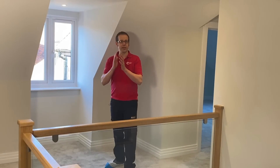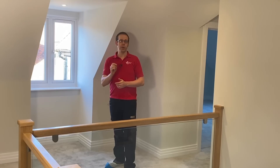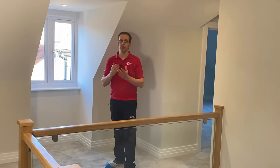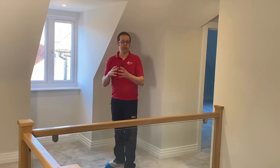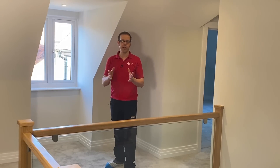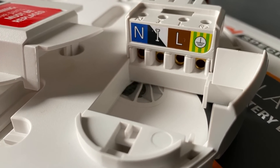It's best practice to keep the smokes on the same circuit as each other for a couple of reasons. One is that it makes safely isolating the smokes easy if they're fed off the same circuit rather than having one on the upstairs lighting and one on the downstairs lighting — there's no room for ambiguity thinking you've turned both off when one is still on. The other matter is that in a domestic situation the sounder is usually integral to the detector, so that if one device is triggered it communicates to the other detectors and sounds their alarms too. This is usually by means of a hardwired connection, with detectors normally connected to each other via a three-core and CPC cable, giving a line, a neutral, and kind of like a switched line conductor for the interconnection.